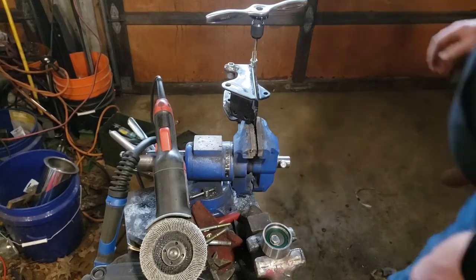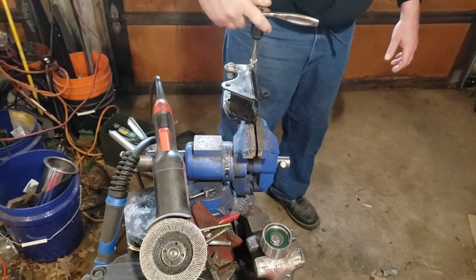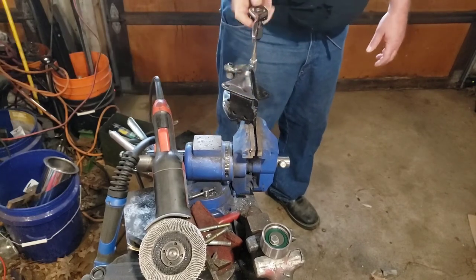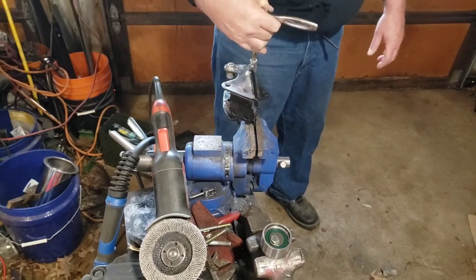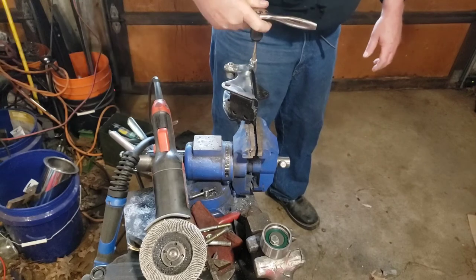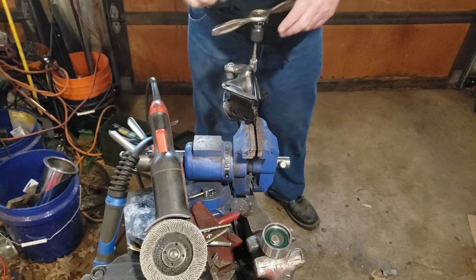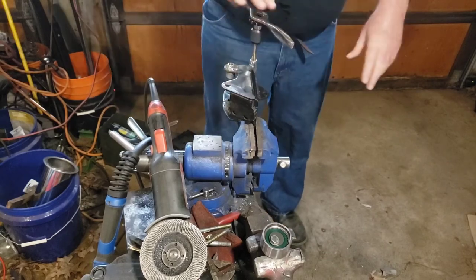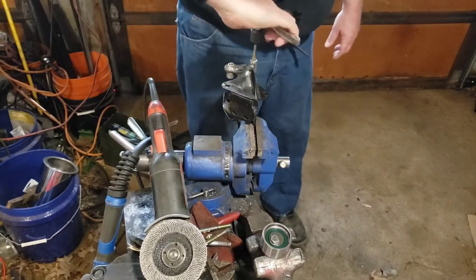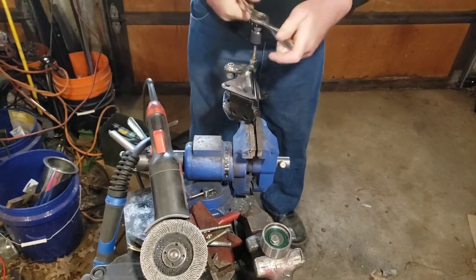That's going to be it for this part. So I trimmed that off, got the pump out, I'm just going to chase these threads, and that's because when you weld this stuff it changes the shape of the metal a little bit. Run this down — I know some guys will just take a drill and run them down, but I don't want to take a chance breaking a tap off. I find that these taps I get at Home Depot and Lowe's — this particular one's a cobalt — kind of brittle, so you've got to be somewhat careful with them. They're fine for chasing threads, but they are definitely brittle.